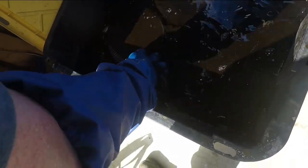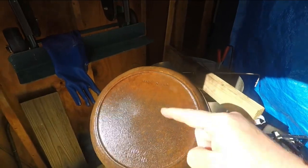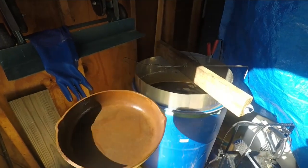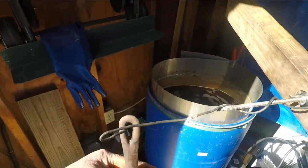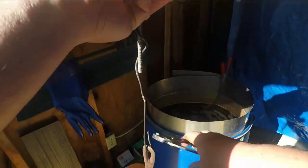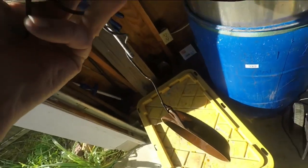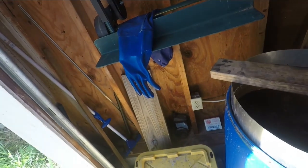I've actually done probably five in this round so you're going to see some cuts and edits, but we're going to do this one here — it is a Birmingham Stove and Range number seven — and as you can tell, it is quite rusty. In the lye tank we have removed all the grease and crud, so that leaves the rust, and we're going to hook it up to our e-tank here. As the skillet sits in the e-tank, the rust from the pan will go to the sacrificial metal which surrounds the edges there, and that is stainless steel.